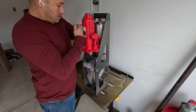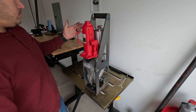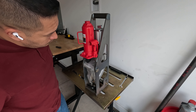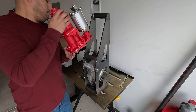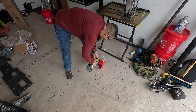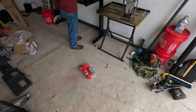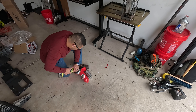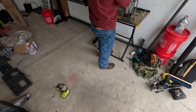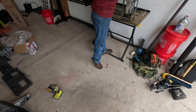After trying to test fit the jack in the bender, I realized it was too wide. This jack is a newer design of the Harbor Freight 12-ton air over hydraulic jack, so it looks a little different from the old one and might be a little bit wider. Bleeping Colt cut off the old handle, so I got to work doing the same, then I ground down the sides of the base to make it fit. Once I got it to fit, I threw the included weld-on jack retention cap on top of the jack and lined everything up.